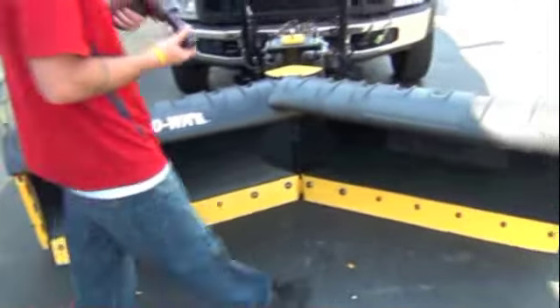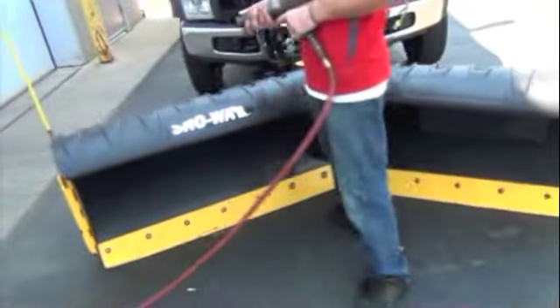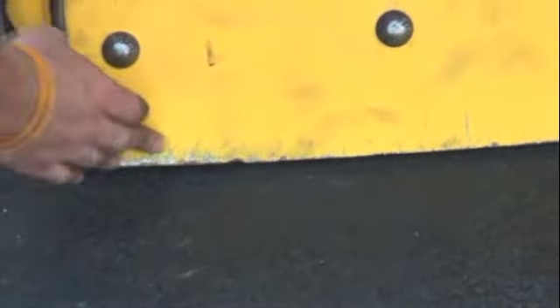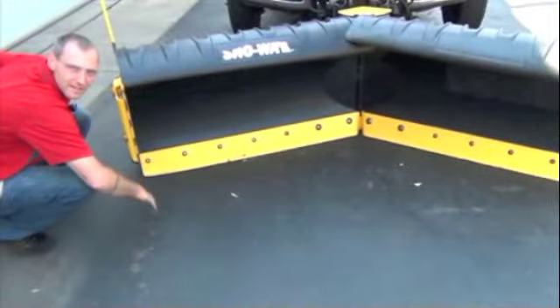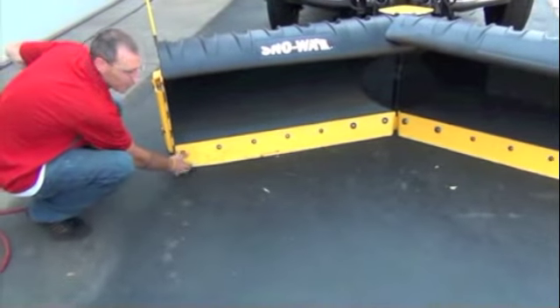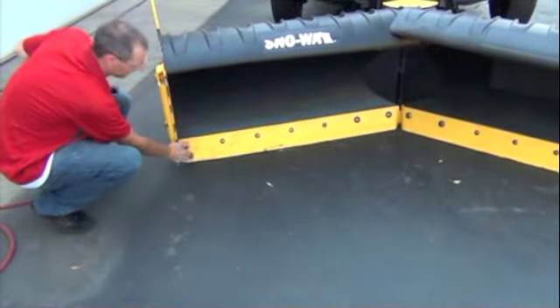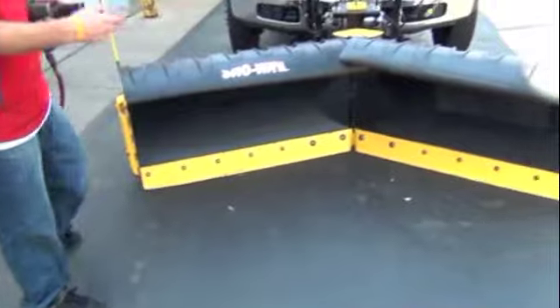As you can see, out here on the passenger side wing we have a little bit of a gap underneath, which means we went a little too far forward — we need to go back a little bit to bring those out to the ground. After the adjustment, coming up to the scoop position, we still have some gap at the bottom of the wing just on the passenger side. The ground may not be exactly level, so take that into account, but we're going to try to adjust it a little more forward to get it touching the ground along with the rest of the wear strip.